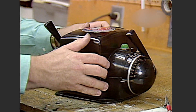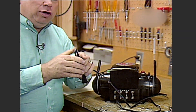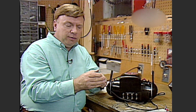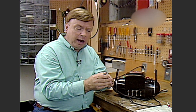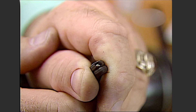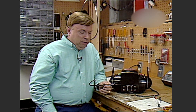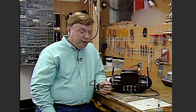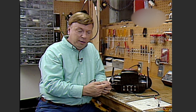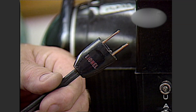The potential danger is the condition of the line cord. If you can bend the line cord like this without breaking the insulation, it's all right, but as you can see when this one bends, the insulation breaks open exposing the wire and a potential fire hazard. Ironically, a lot of collectors will pay more and put more of a premium on the transformer because it has an original line cord on it. However, that means the cord probably is a potential hazard and needs to be replaced.